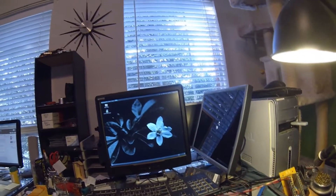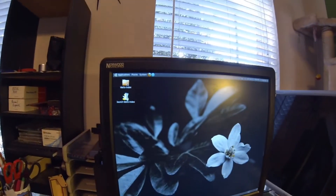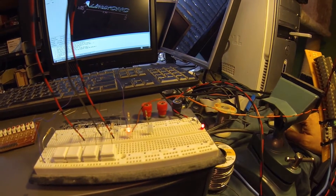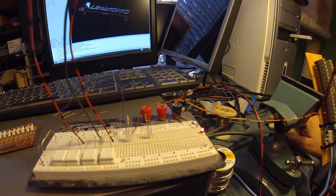If we go over here and I launch the program, enable it, and go to the motor controller — you can see I can turn the motor on and off. One thing I did notice was that when the computer was not running the program, that pin was turned on. So I think I'm going to have to take one of the pins and make an enable signal out of it, so the motor doesn't inadvertently start up. But that's all part of the fun of getting this thing going.